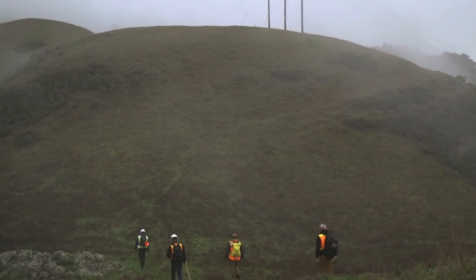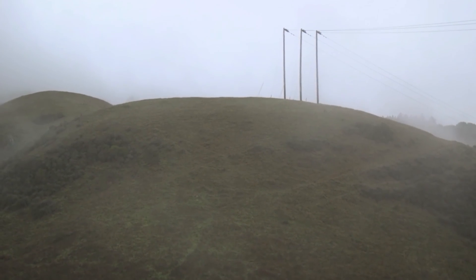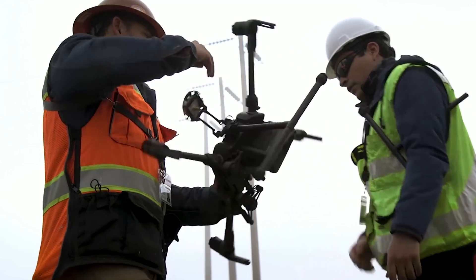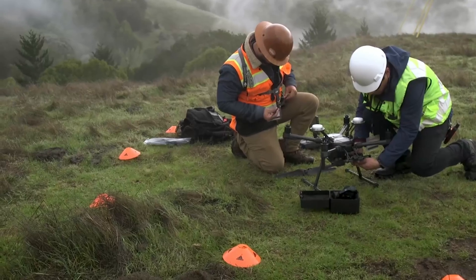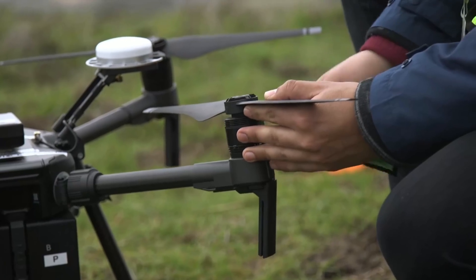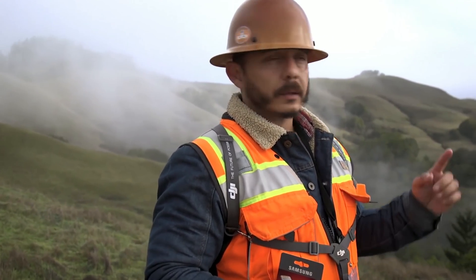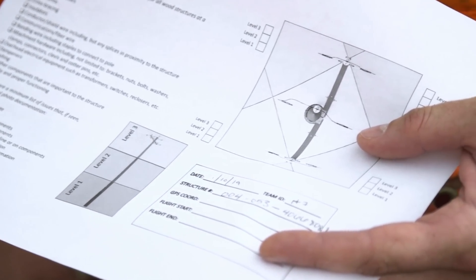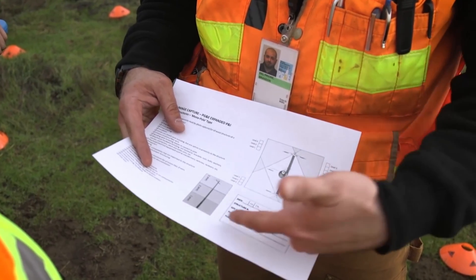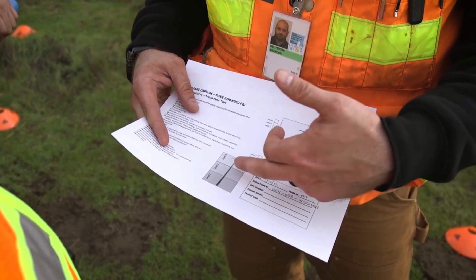We don't orbit around it — it's more like an up-and-down motion. We try to align ourselves at 45 to 60 degrees to the pull center for each one, and then take shots at base, mid, and conductor level so that you capture guy wire attachments.